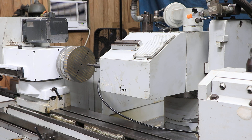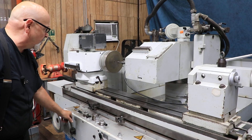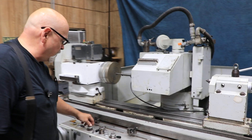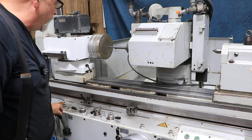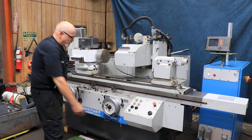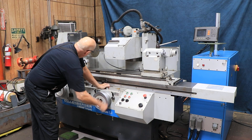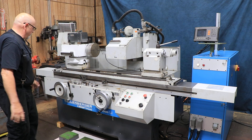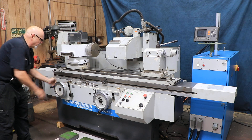So that's the machine shown in the ID mode. You certainly want to be careful about your table. This infeed has a fast ratio to position the slide where you want it, then you put it back into normal. You also have the same system with your table — a coarse ratio and a very fine ratio.